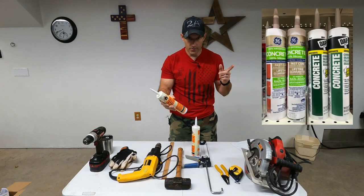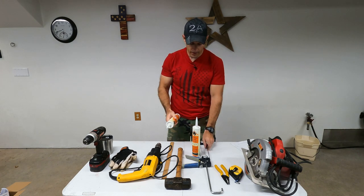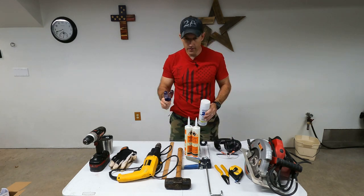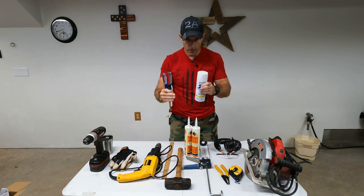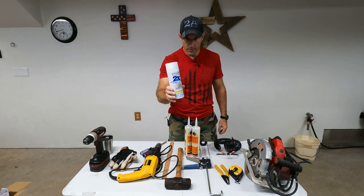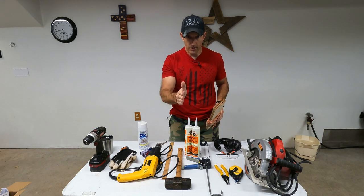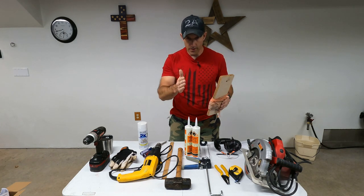If you cut your driveway, you'll want something to seal the crack back up. I have asphalt so I bought asphalt sealant — for concrete, just ask a hardware store for crack sealant. I'll also use a couple screwdrivers as stakes to hold the wire while I start, and some paint to mark corner areas. Since my property is nice and square, I'm using an orange string line to keep a nice straight line with the rented machine.